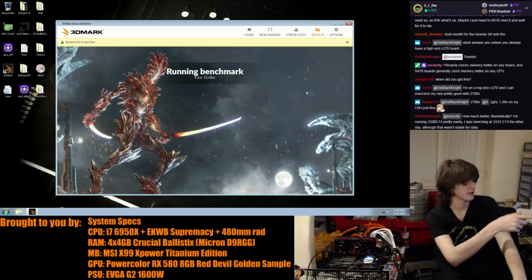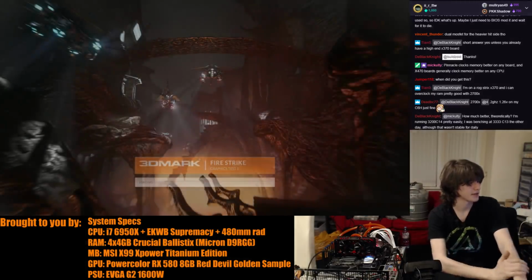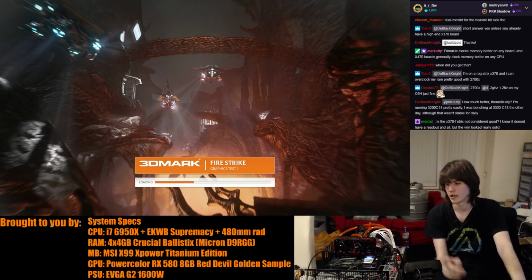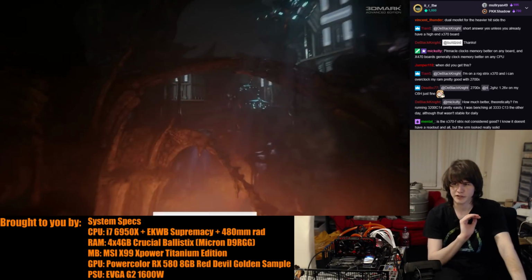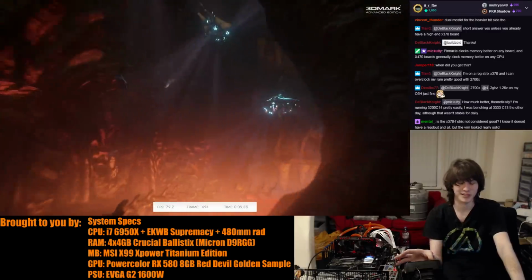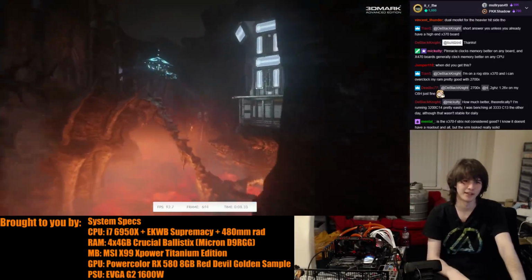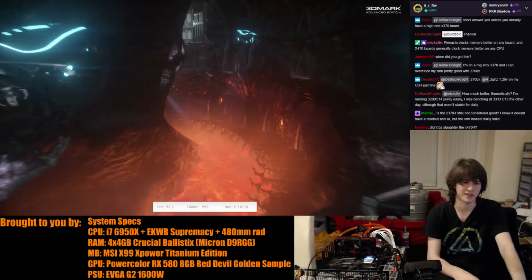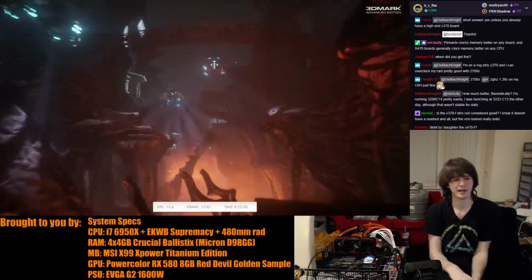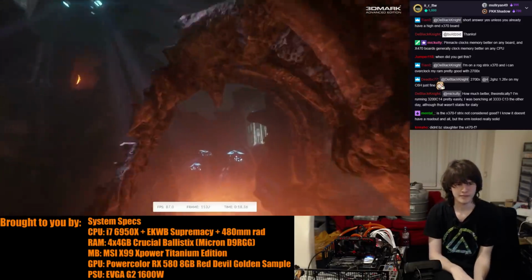So what McCulty is saying about X470 boards generally clocking better on any CPU, that is very true, actually. Even the MSI X470 gaming board I tried, with my Ryzen 7 1700, was doing CL12 at 3600 megahertz. It's the first board where I've actually seen those kinds of clocks at that kind of timing, which is just crazy, because I didn't think the CPU was even capable of posting that. And on that board, it's just like, yeah, you can run that, it's fine. So, yeah.